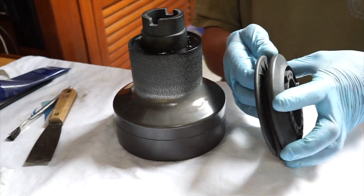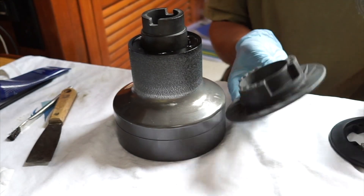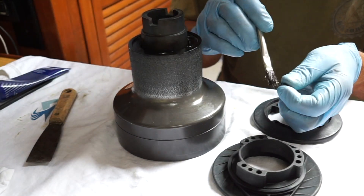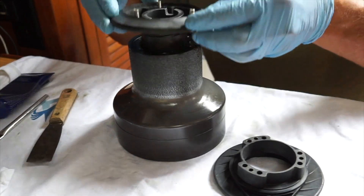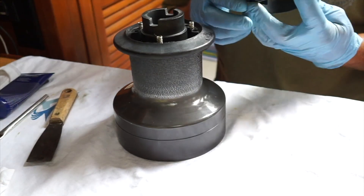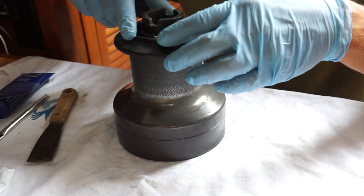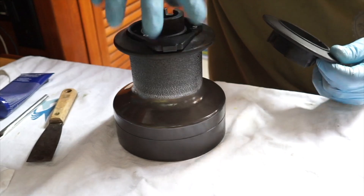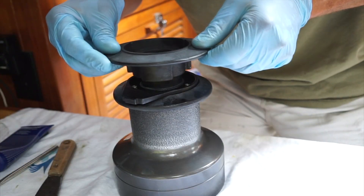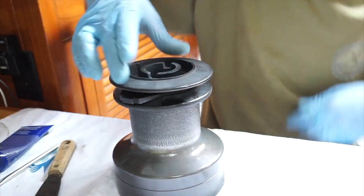Now the tailing jaw — it's actually a three-piece system: the tailing jaw, the rope stripper, and the bottom jaw. I've got these springs to pop out so I'm going to put some grease on those as well. The tailing jaw sits inside here, face down. Inside this mechanism I'm going to put a little bit more grease where the plastic rubs together. Spring loaded — very nice.